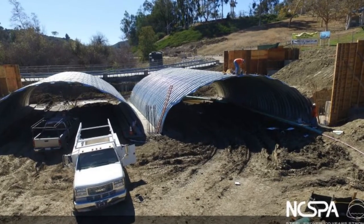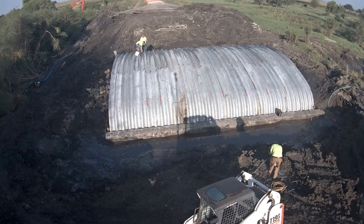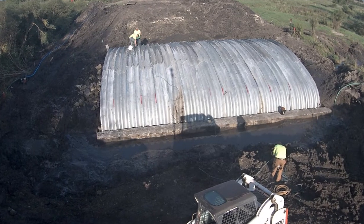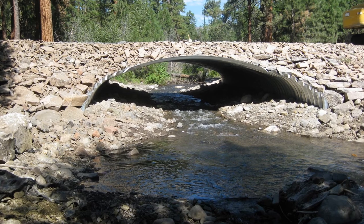The main difference between a buried bridge and a beam bridge or traditional bridge is that buried bridges are flexible, and rather than the bridge ending at essentially just below road level where your abutments start, the base of the bridge is actually much deeper in the ground. So in a hydraulic application, your foundations are actually buried at or below where the stream elevation would be.